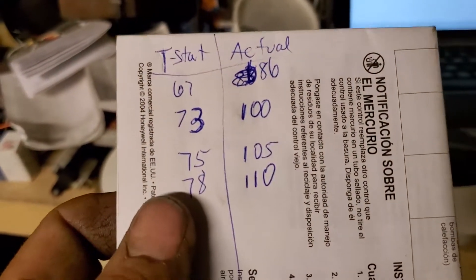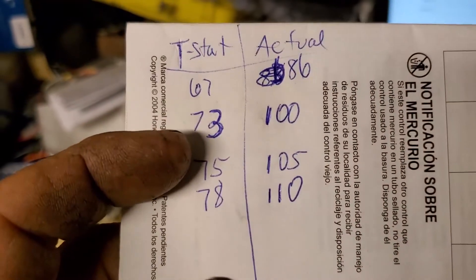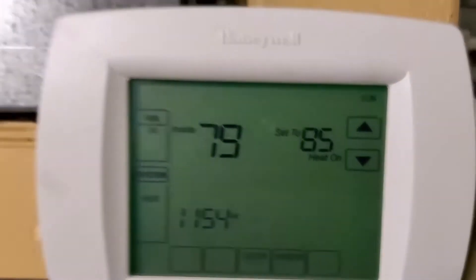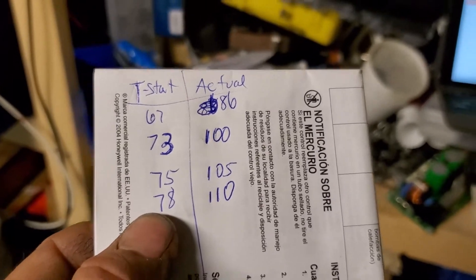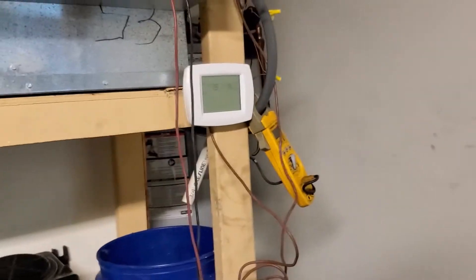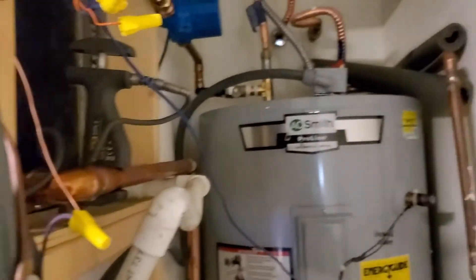As I've been plotting this, there was a pretty big jump in temperature, but it could be just how fast it heated up. I noticed about every two degrees on the thermostat is about five degrees of water temperature coming into the heat exchanger — so right now it says 112 and that says 79. The good thing about cutting the degrees in half like that is the water in the tank will change even more — two or three degrees for every degree that reads. That'll slow down the cycling of the compressor while I'm using this as a temporary controller, since you can't manually set cut-in and cut-out like on a commercial thermostat.